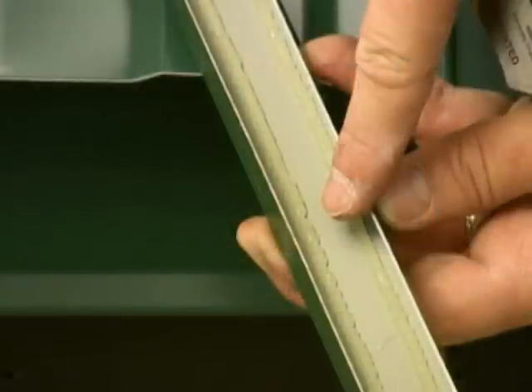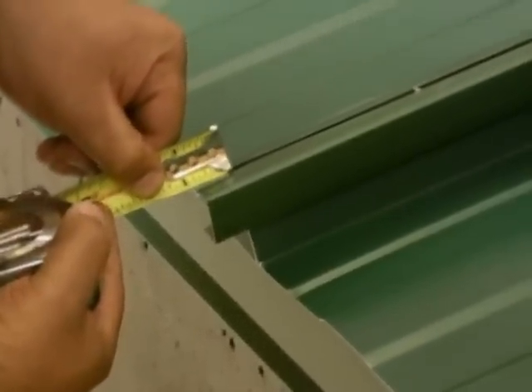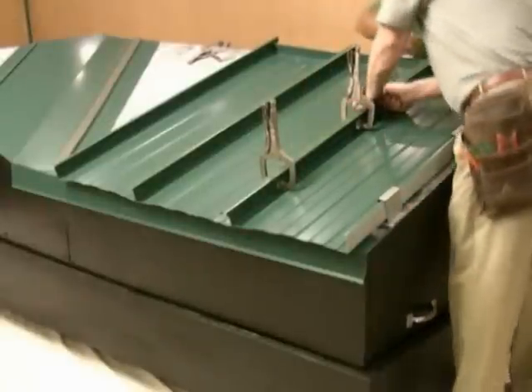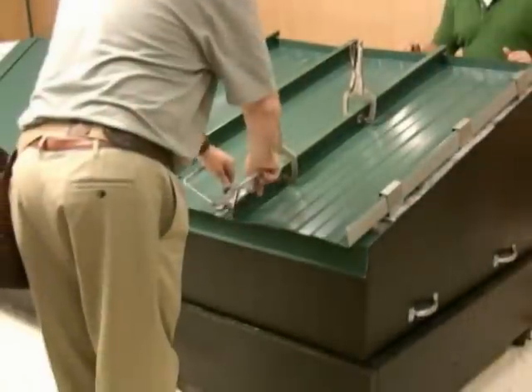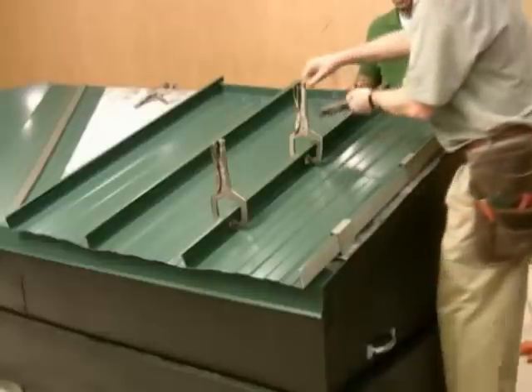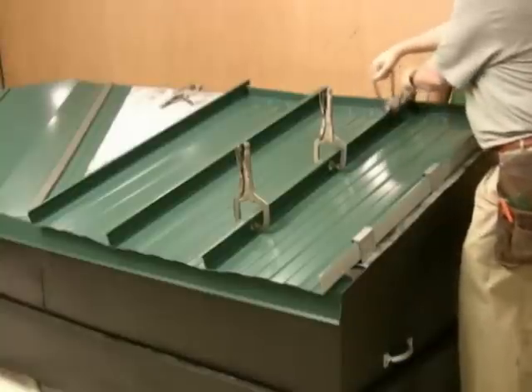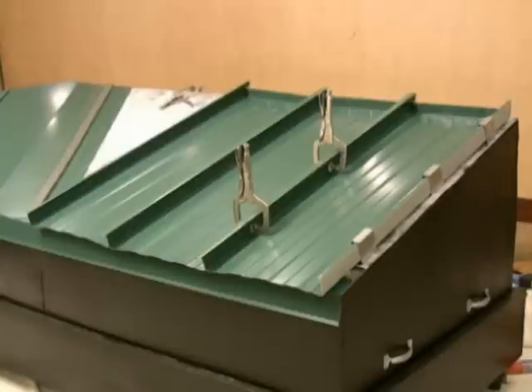With our panels now in place, the seam cap may be installed. Note that the seam cap comes with factory installed sealants. This butyl sealant is very tacky, so ensure proper positioning prior to setting it in. You will not be able to reposition the cap once the sealant has made solid contact with the panel. Slide the cap down the length of the seam upside down. Next, position the cap so that three-quarter inch is extended beyond the panel. Rotate the cap over the seam legs starting at one end and work to the other. Once the cap is set in position, hand crimp the top, at the bottom, and at every clip location along the seam. The purpose of the hand crimping is to temporarily bind the seam cap in place until the mechanical seamer may be used. The seamer is usually not used until all panels are installed, so it is essential that the hand crimping be done as the caps are installed to provide strength and water tightness.